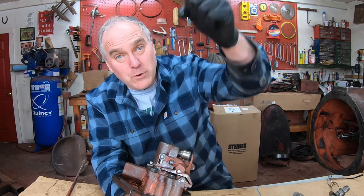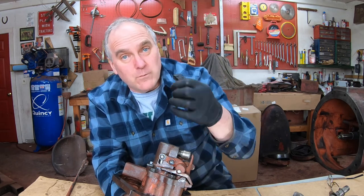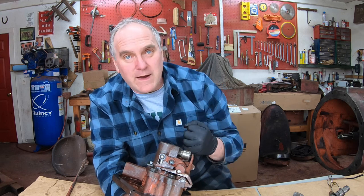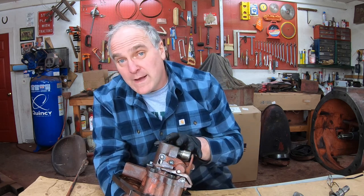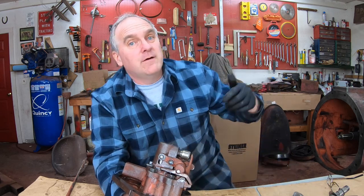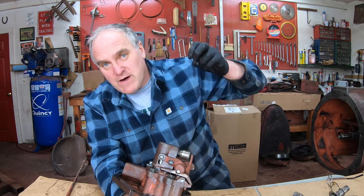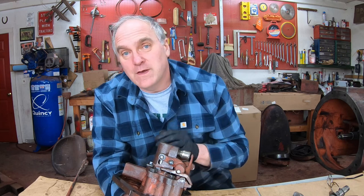It's important to note that this is a one-way pump — it has pressure going out to push the cylinders out. But when you want to lower the implement or retract the cylinders, this pump doesn't power that retraction. Gravity powers the retraction — the weight of what the cylinders are holding up forces fluid back into the pump. These pumps can be converted to two-way — power raise and power lower — by adding a hydraulic valve downstream of the pump, or there's also a two-way valve that International made that goes on the tree at the fill port.